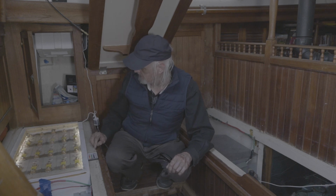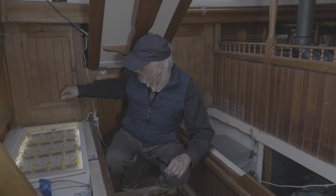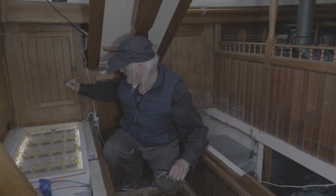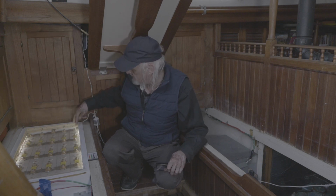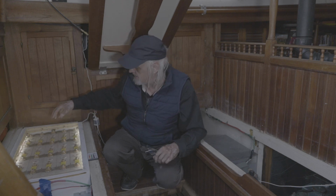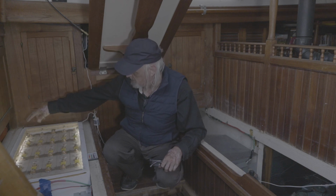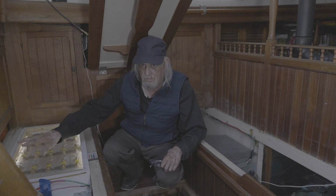But at any rate, how I did this was each one of these cells is 3.2 nominal voltage. And so I wired them up 5 cells in parallel. That makes like a big super cell, and so it's still 3.2 volts. Then I have 4 sets of those. So that's one supercell, here's another supercell, here's another supercell, and here's the last supercell. So there's 4 of them.